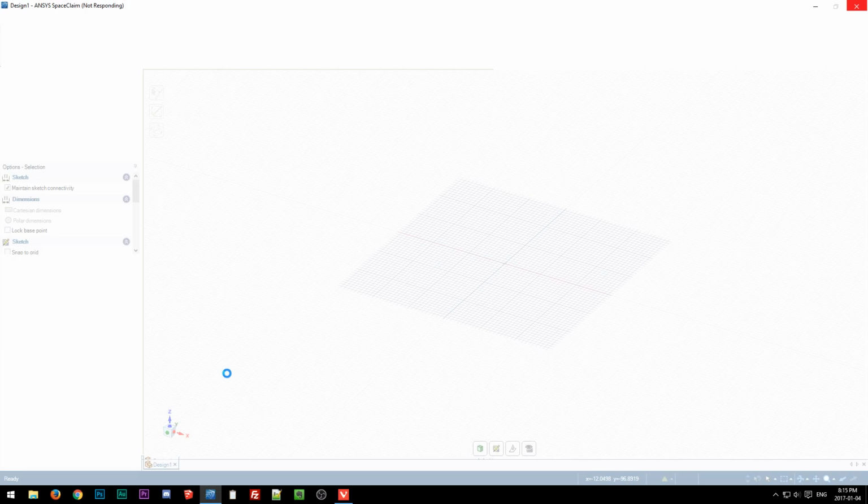So that's the traditional 3D modeler. Blender, 3ds Max, Maya, all those are vertex modelers. CAD programs, because they have to deal with physical objects, are typically solid modelers. They treat 3D entities as a solid object, which sounds kind of obvious, but the implication is if I model a cube in a solid modeler and then slice it in half, I don't end up with two hollow half cubes. I end up with two rectangular sections that are still solid, because I cut a solid object in half and now I have two solid objects.